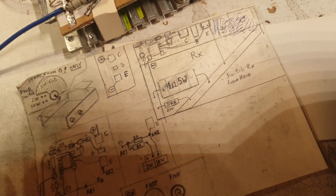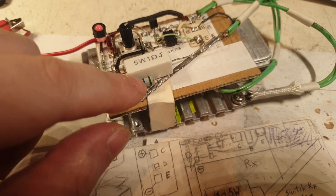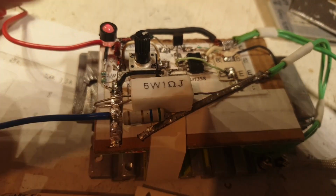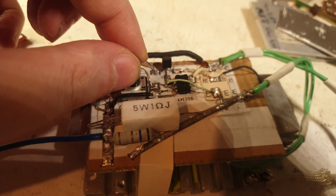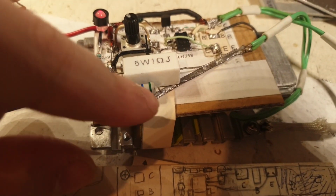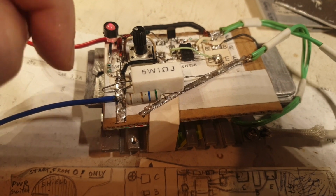Good. So that's why I chose this lower wattage resistor, that is terribly hot right now when it's running at its maximum, and I can probably smell it a little bit when it's running at its maximum wattage. I'm not completely sure, maybe it's 1.5 watts, but it's for sure a little bit bigger than 50 degrees Celsius there, or it's very hot. So I will not let it run at that temperature, because this is getting extremely hot, this little one. But if it's lower than its maximum, it's pretty cold. It's running pretty cold, so it's good enough. It's good enough what I'm having here.